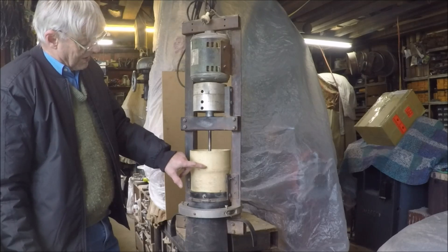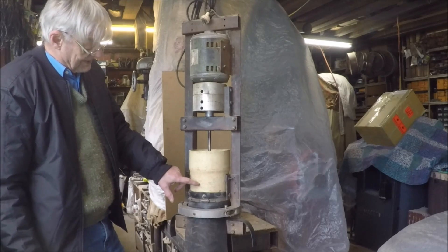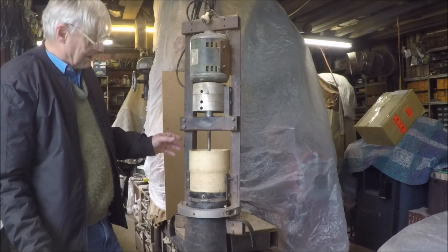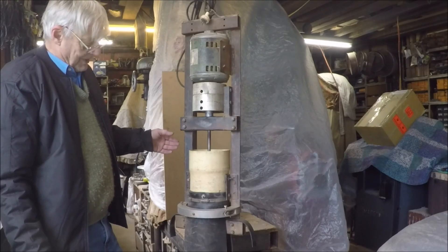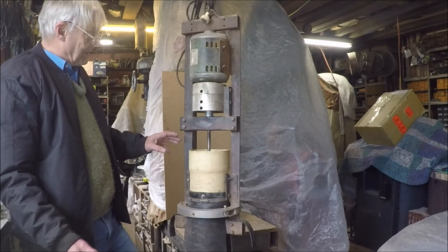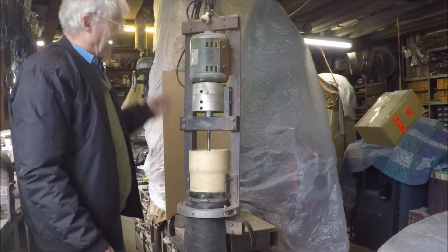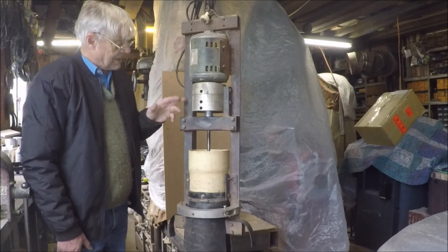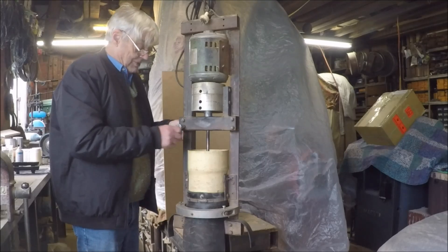This is a piece of the socket end of a piece of six-inch drainage pipe that I happen to have lying around. I decided initially to build the machine quite small like this, thinking if it worked I would build a bigger one. But 30 years later I've never built the bigger one because this one processes the sand pretty quickly. I would prefer it a little bit bigger, and if I was building it again I'd make this about eight-inch diameter rather than six, and I'd probably use a genuine one-horsepower motor.